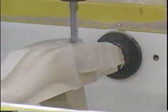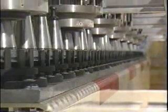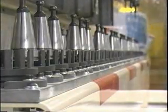The actual cutting speed depends on the shape and contour of the pieces being carved. The amount of cutter stepover determines the cycle time and surface quality. The larger the stepover, the faster the cycle but the rougher the part surface; smaller stepover means longer cycle times but smoother surfaces. Each company has to strike its own balance. When the surface has been defined, the first tool is replaced and the second tool retrieved automatically on all eight spindles at the same time. The various detail programs are then executed.